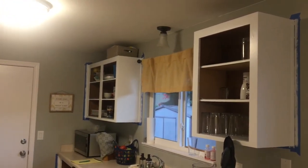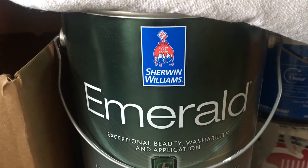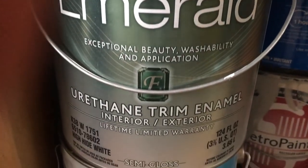You might be wondering why we didn't spray, because we do have a paint sprayer — we own one and it's great. But the reason we didn't use it is because you have to thin the paint with water in order to spray it and have the spray nozzle not get clogged up. We really just didn't want to thin this paint with water. It's wonderful, high quality paint and we wanted the full strength on our cabinets. So we said to each other we'll give it a go with the roller, and if we don't like how the finish looks, we'll roll two coats and spray the third.